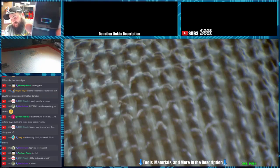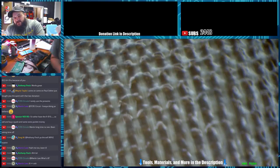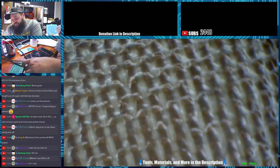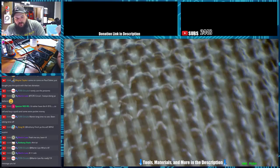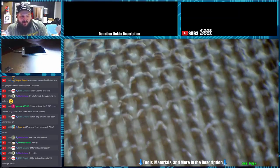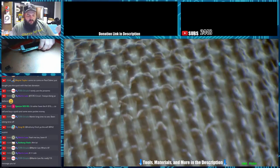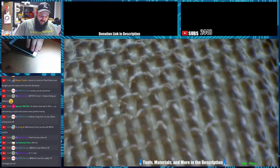Alright, so we have a charging symbol now, and we're pulling 1 amp on the charging board over here. So you all can see it. I know it's kind of hard to see, but we're pulling 0.9, it's 980 milliamps, so that's perfectly normal for that amperage board, so it was TriStar. We'll charge it up and test the battery and make sure that the battery is good.